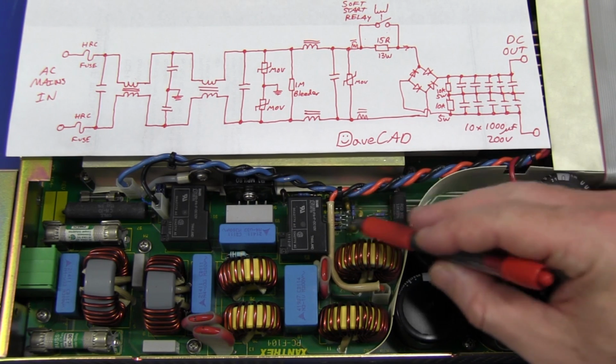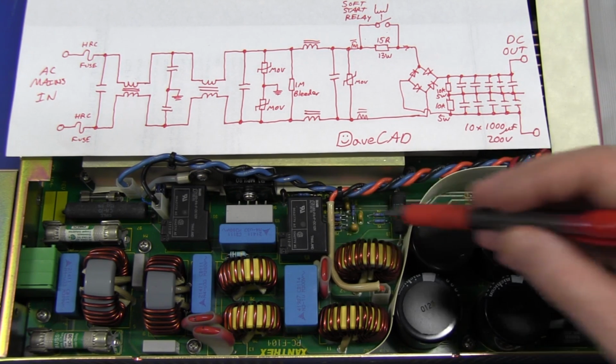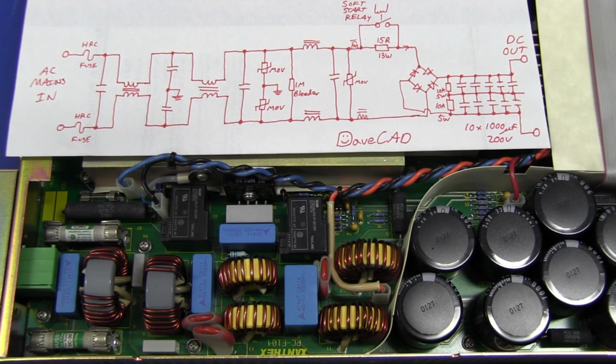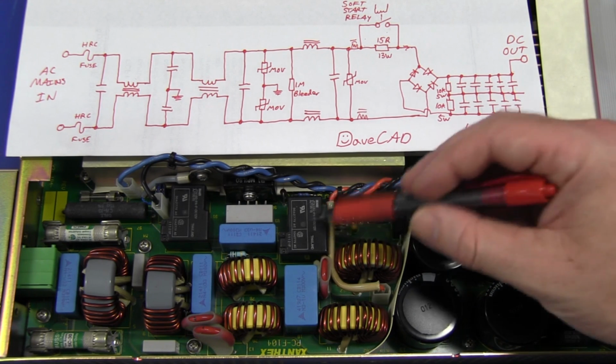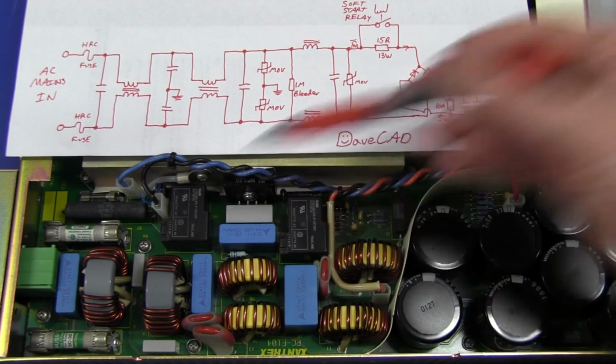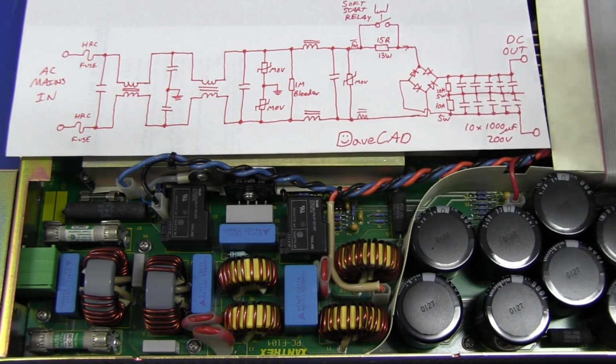And there's a bit of control circuitry down there. It's probably an op amp or comparator or something like that. And obviously, maybe it's doing some extra mains failure protection or mains failure detection or something like that, perhaps, and there might be another relay to automatically switch off the power there. But there you go. It's a pretty basic operation, but because it's big and high power, that's why you need a huge board this big. You need the massive inductors, the big filter capacitors, the big MOVs, and really it takes up a lot of room.